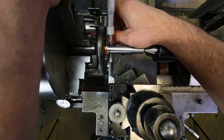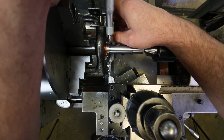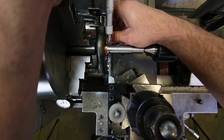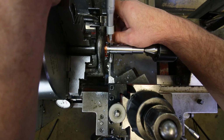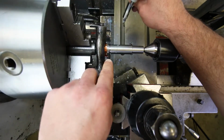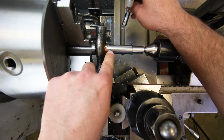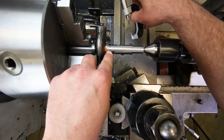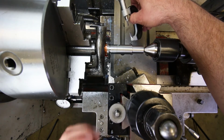And over here, what am I getting? Wow, 668 and a half. So I thought that my alignment was a little bit better than that. But I'm 0.02 from side to side. That's not awesome, but we can still get inside of our tolerance. As long as we're inside of our tolerance on both sides, everywhere inside of the groove, then we're okay. The closer our alignment, the less tapered this surface is, the easier it's going to be to hit that tolerance. But we could technically be 0.05 out from one side to the other, as long as one side was at the lower limit, the other side was at the upper limit. Okay, so this is going to be fine.